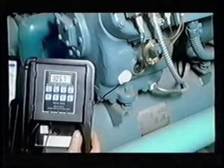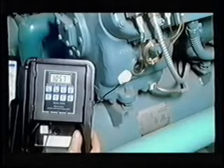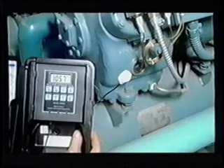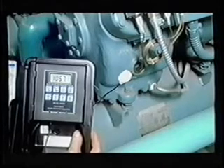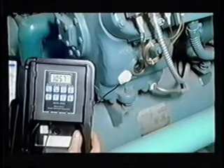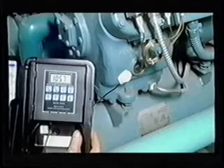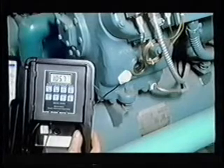Typical normal operating temperatures for 06D and 06E compressors are: oil temperature, fully loaded, 90 to 125 degrees Fahrenheit; unloaded, 90 to 135 degrees Fahrenheit; discharge gas, 60 to 100 degrees Fahrenheit above saturated discharge temperature; motor barrel temperature, 60 to 105 degrees Fahrenheit — it can be as high as 150 degrees Fahrenheit with 06CC models.